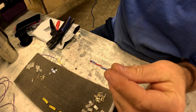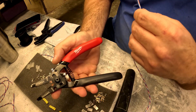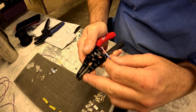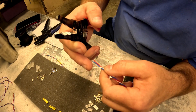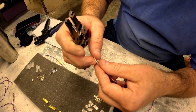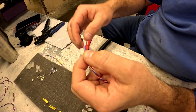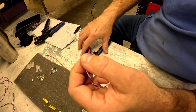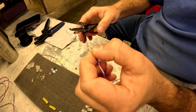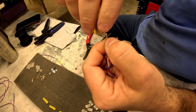The signal wire here is a little smaller gauged than the rest. I've found these Milwaukee wire strippers from Home Depot work well — for stranded wire it's 22 up to 32 gauge. I've been using the 26-gauge setting for the white signal wire and 24-gauge for the red and the blue, and that seems to be pretty good sizing for stripping this stuff, since it's technically spec'd as a metric size. Because the signal wire is smaller, you have to strip a little more material — about double — roughly three-eighths of an inch, which is around nine to ten millimeters of wire.